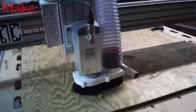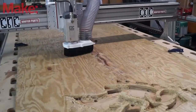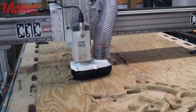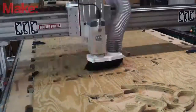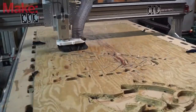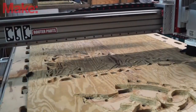My first run I goofed up somehow — I have no idea what I did but the end mill snapped and I had to start over. After that I had no problems at all. I think I slowed down a tiny bit but didn't change much else, so it could have just been a fluke. The only problem I had was that these big three-quarter inch boards were warped a bit, so the depths weren't consistent, and the pressure-treated lumber just seems kind of damp to the touch.